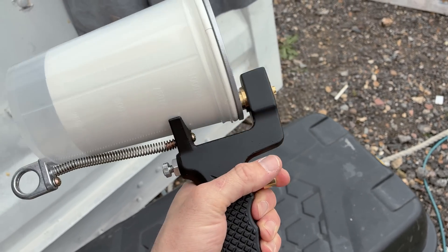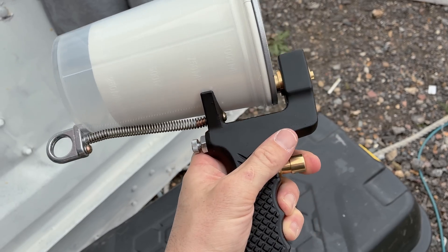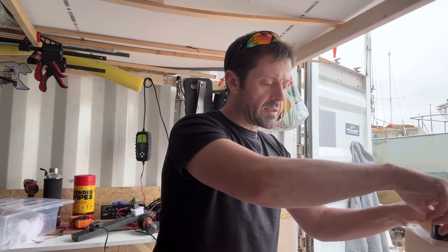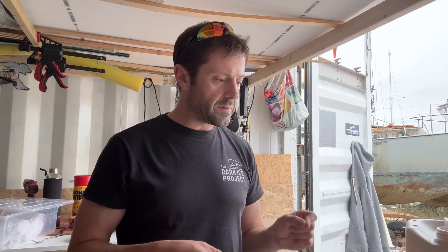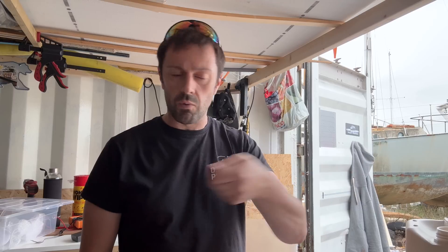We want to apply resin fast but controllably, and at the moment I have no idea where within the range of slow, fast, very fast, pot empty in 5 seconds fast — so I settled on the slowest position that didn't sound spitty or inadequate. We won't go too crazy on the resin type this time around; I'll just use some polyester resin. It's cheaper, and it's roughly the same viscosity as the epoxy that I'll be using, so we'll just use that and some MEKP catalyst. I'm going to try and go for a 45% resin ratio to a 55% fabric ratio, and see if we can wet out that whole sheet properly.